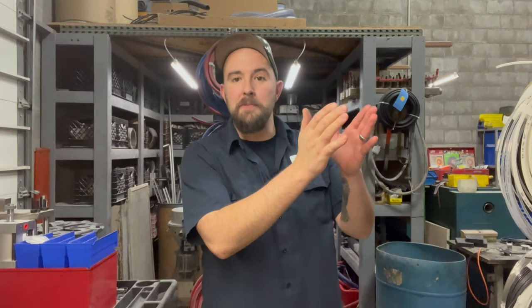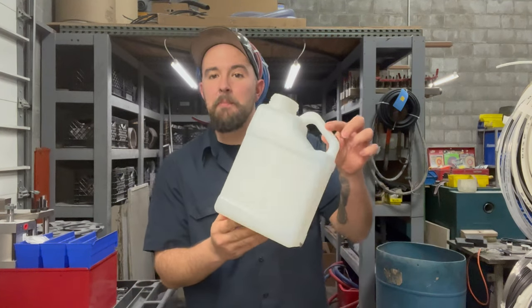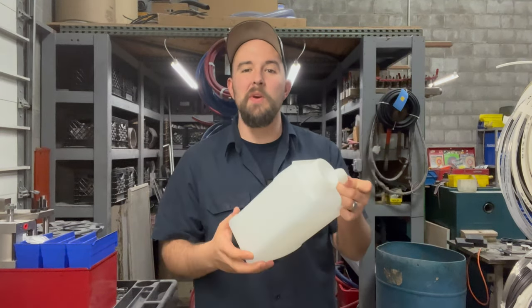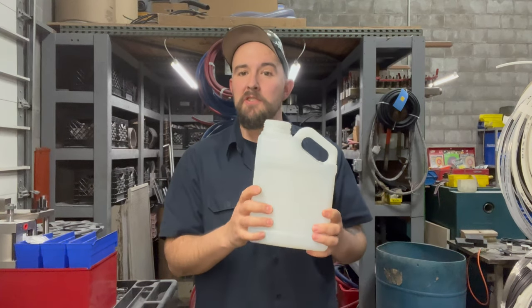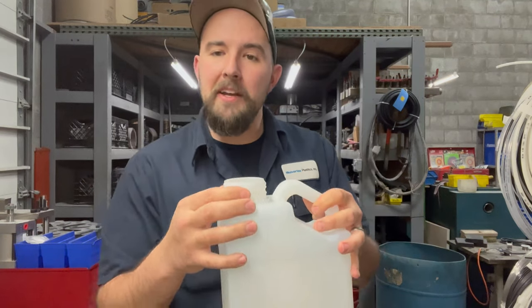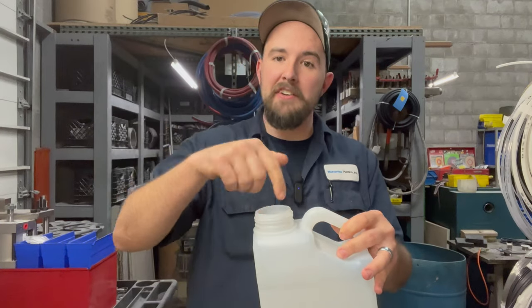This is also what's referred to as a shuttle type machine. Whenever you saw that mold closing, moving up to the parison, going down — that's what we're referring to as the shuttle. That clamp and that whole mold procedure, that is what a shuttle is. Over here, this is what that machine makes — a one gallon multi-use jug. Customers call, order this, and put whatever they want into it. The threads and everything on the top of this bottle are made inside of that mold, so this isn't something that gets done afterward.